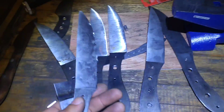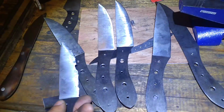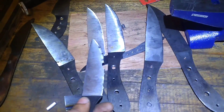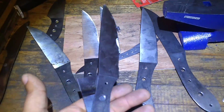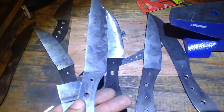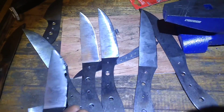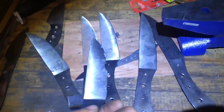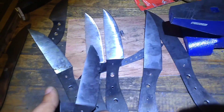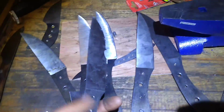The 20 thousandths geometry cuts poorly, so I'm not designing knives to hold 20 thousandths at 15 degrees per side — I'm going to meet it halfway. We need to drop these down to 15 thou behind the edge to get increased cutting quality, otherwise the cut will wedge and won't perform the way you want. The 20 thou is too thick — it'll hold up to the aluminum test, but I'm not designing a knife to cut aluminum. I'm going to drop the geometry down between 10 and 20 thousandths.